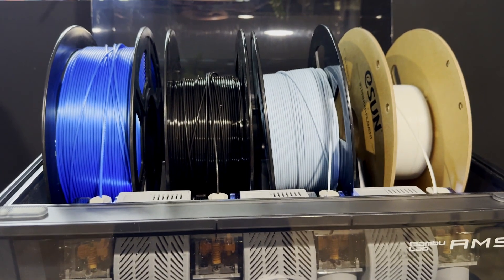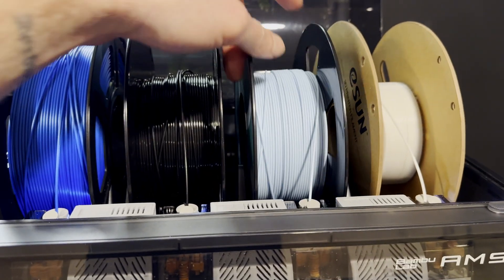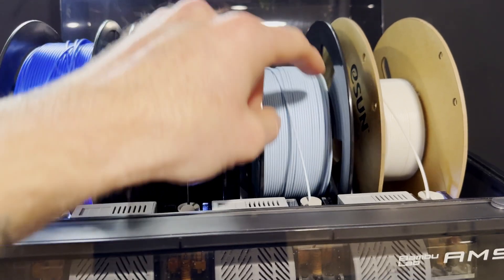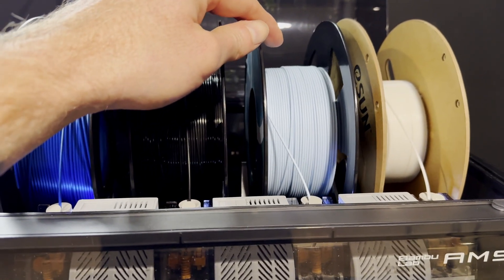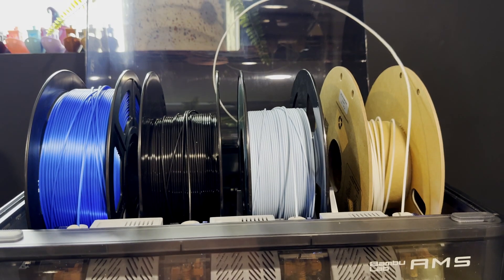On the flip side, I have all kinds of problems with the AMS system itself. If the roll isn't full enough it'll kick up when pulling filament; if the roll is slightly off-track it wiggles and puts too much pressure on the pulling motor and stops — reporting a jam. Another issue: if the roll is too full, it doesn't retract fast enough, causing filament to roll up into a top dome and tangle. You end up having to snip it out.